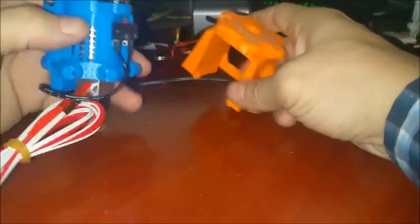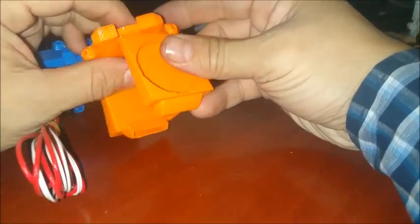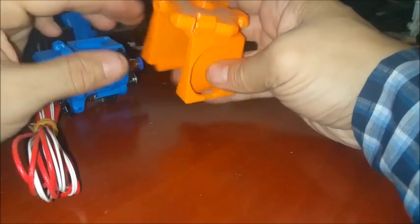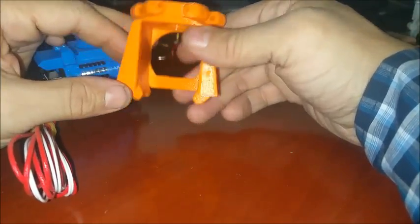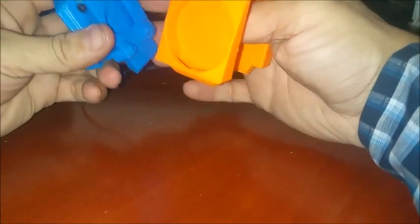There's another one I have designed that I use on a couple of my other printers. There's no auto level with this and it's made for maximum cooling of your filament, which might be unnecessary. But I find this cooling is good for PLAs that have a metal content — like when I'm printing copper-filled PLA. I prefer cooling like this so I don't ruin my heat sink with the copper heating up inside and jamming it up.